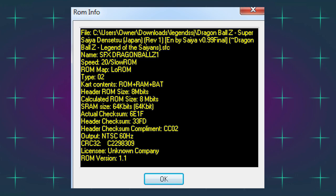I loaded it up here in SNES9X, and it really gives us a lot of information about the game. The ones we really need to worry about: is it a HiROM or a LoROM, which tells you which boards we can use; how large the ROM is itself, which we can tell from the file size of one megabyte, or in this case eight megabits; and then we need to know if it uses SRAM to save. In this case it uses 64 kilobits of RAM to save on, and that's pretty much all we need to know to make this game.